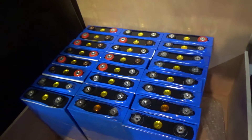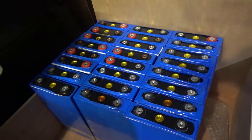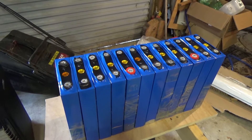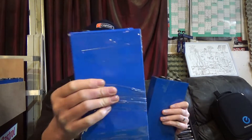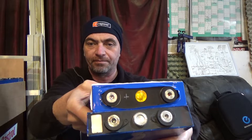I'm going to throw them together, put them through a cycle, and see what happens. I'll have to make new bus bars because they're 5mm wider than the other ones, and I need a new battery box because they're taller and wider. Because these cells are so much heavier I'll make two separate packs of 12 and connect them in the bus. They're a bit taller, a bit wider, but not quite as long, and about half a kilo heavier.